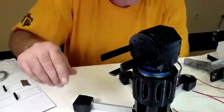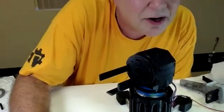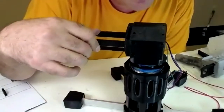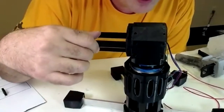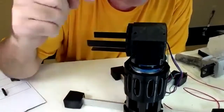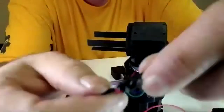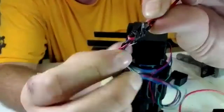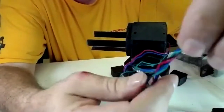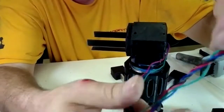So I'll open it up to questions, comments. I see right here, James asked, would tying them in a knot, that was my earlier failures on getting those wires through, be too large? Yes, James, the diameter in there isn't that massive, but as you see, what helped me was I just looped the lead cord around and then tied them up. And the other thing is make sure you do a wire count after you get it through. If you lost one in there, that's just going to be painful.